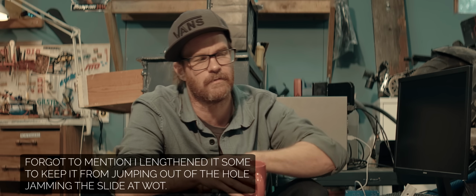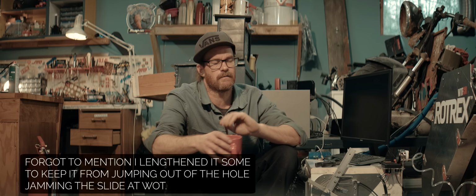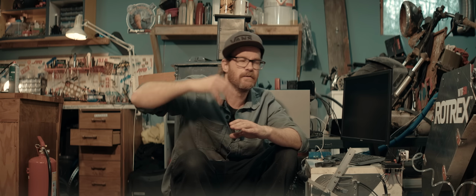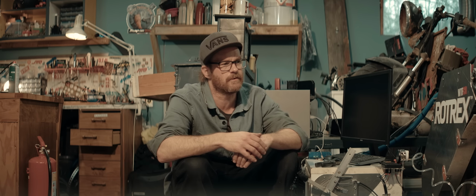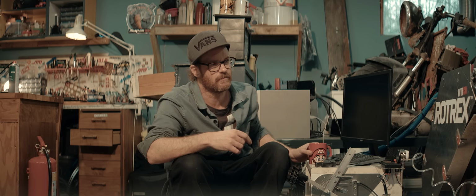That result strengthens my fuel puddling enrichment circuit theory, and it felt like it was behaving much less erratic than before. The carb is delivering a little bit less fuel now with the metering rod further down into the hole. I don't think enough to make such a difference. I think we had fuel puddling behind that step before, and it was delivered into the engine in chunks, acting as an enrichment circuit. Might actually be this engine isn't that hard to get going after all, that it's been that carb step screwing with us.